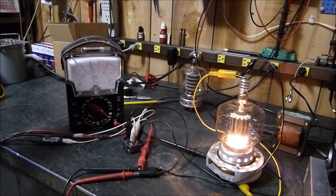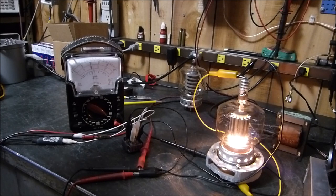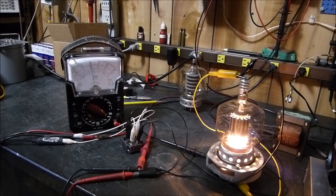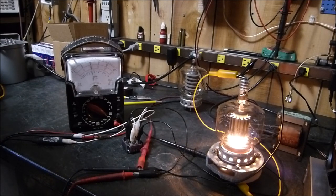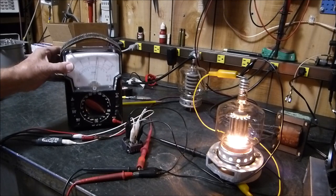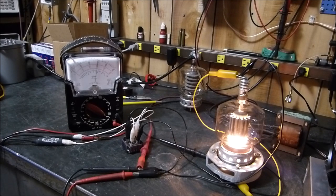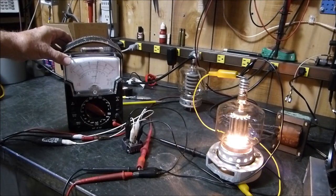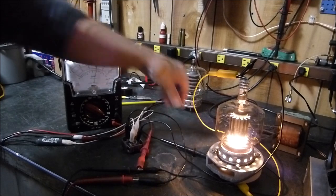The voltmeter glitched — maybe something like an air conditioner turning on and off. Now I'm going to run the voltage up to 60 volts. You can see how the current is climbing — it's up to 600 milliamps — and it's starting to climb again, not steady. Then my voltmeter went to zero from a loose connection, but I got it back.